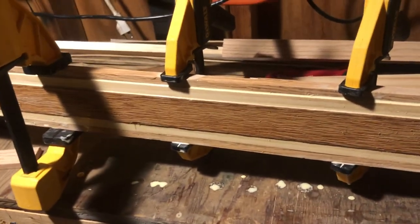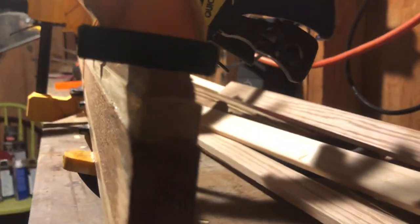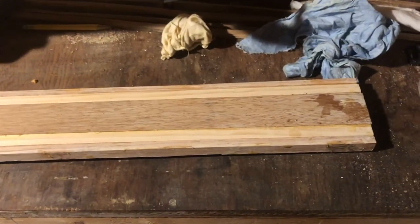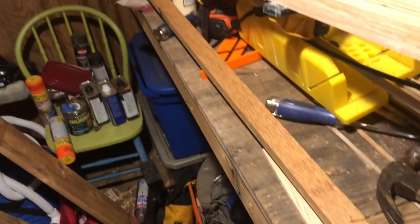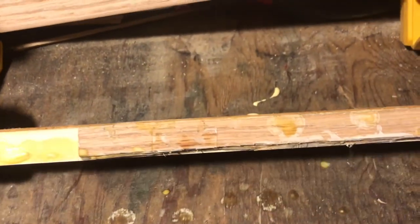I glued it in sets because of the awkward shape and uneven nature of it. You can see on the end that it's kind of tapered — each piece is a little bit skinnier than the shaft, and that was just to help make a natural curve for the paddle blade. The finished product is looking pretty good, glued real solid, no problems, plenty of good clampage. It's starting to take shape — you can see that tapered characteristic.